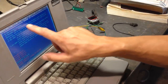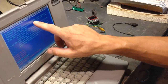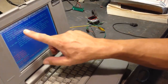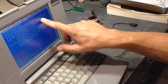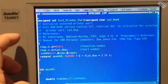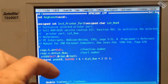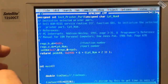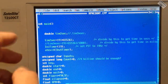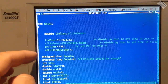That happened to be the day after Thanksgiving. When I originally made this, I was trying to build a wind indicator, and I was using the Hall Effect switch from an old floppy disk drive. This sets up the printer port so we can read pin 10 — that's really all we care about. Pin 10 is the acknowledge line, which returns information from the printer. It's input instead of output on the printer port.